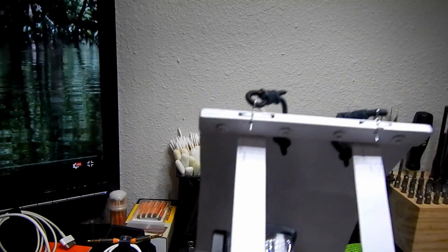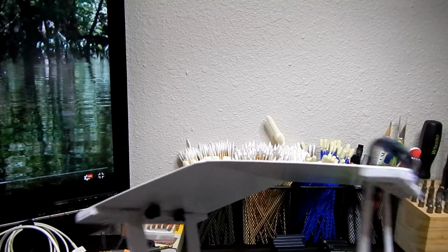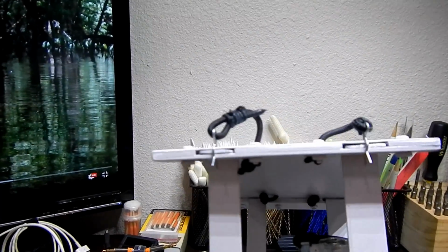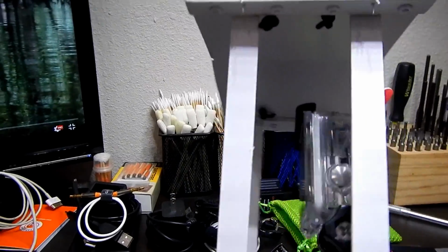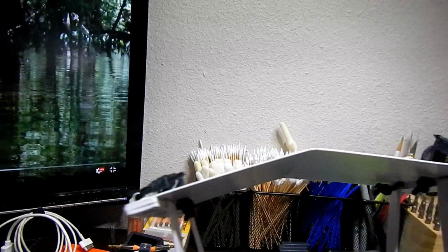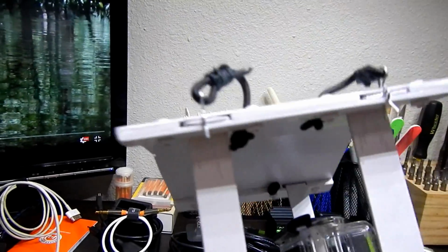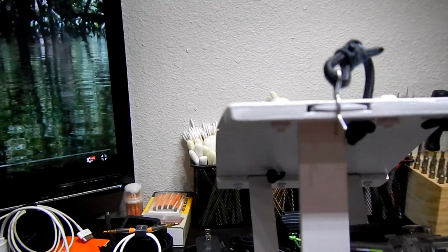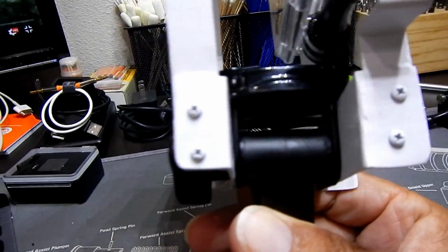At the end of this, because I did this once without it painted and it didn't come out right, I have a little video where you can see it in the rough form. It's all sheet aluminum and some, not tube, but some bar aluminum, about 1/2 inch by 1/8, and 1/16 inch sheet aluminum. I was initially going to glue it all with epoxy, but the epoxy just did not give me enough bite, so I ended up having to throw some small stainless steel screws in it, and the rest of it's all aluminum.